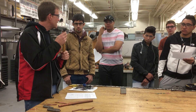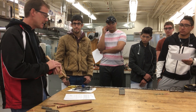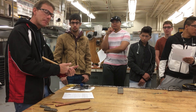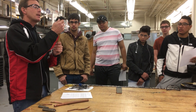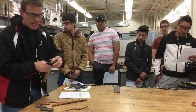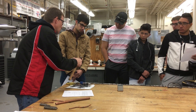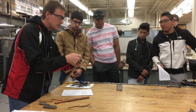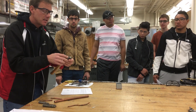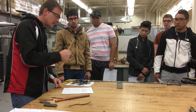If the head's loose on the shaft of the handle, there's a little wedge that goes in the center that we need to tighten up. Some people just like to bang it on the ground — that's not the right way to do it, because it does jam it down into the fatter part of the handle shaft, but it's not really doing it right. It's supposed to spread out. There's a little nail or spike — we call it a shiv — on top. It's a pie-shaped wedge that stretches out the face of the handle under the top of the head.